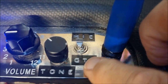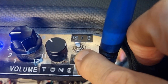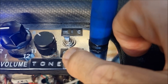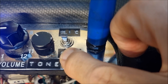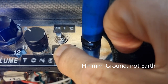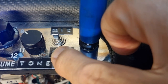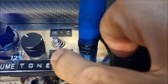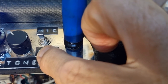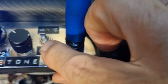And basically, you may know that a lot of the very early valve amplifiers, certainly before 1950, the bias on the first triode after the input was by grid leak, so that the cathode was connected to earth, and there was a large value resistor, usually about 5 meg, to ground from the incoming signal line, sometimes with a small value capacitor in there as well. And this was known as grid leak bias, and it is favored by blues harmonica players who use those old style amplifiers.